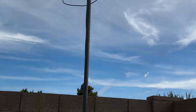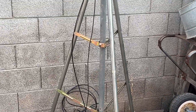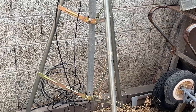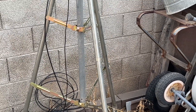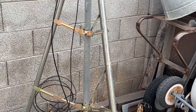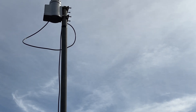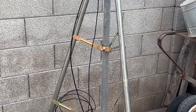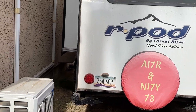I would suggest really good coax. I got 150 feet of coax — it's from Amazon because it was easy. I tried using something that said Tandy on it — okay, that tells you just how old it was — and it was not working well. This one isn't even marked, but it's RG-8X, I think. Anyway, I dug it out. It's nice and solid, double shielded — it's got the aluminum shield around the center and then the copper braid, which is 100% coverage, really tight. I put new connectors on and put it up. I had the Tandy one on and it was picking up more noise than the vertical, so I knew something was wrong. By changing that out, it runs around and goes into my shack near the front of the house.